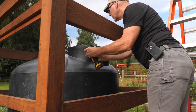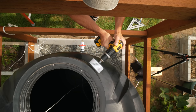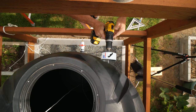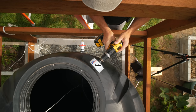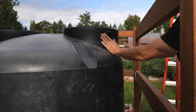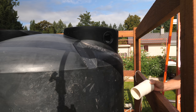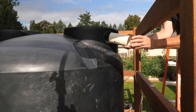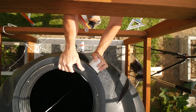I'll use a large hole saw for the inlet and overflow pipes. I drilled until the pilot bit pierced the tank, then clicked the drill in reverse to cut the big hole. This keeps the hole saw from grabbing, and it worked really well. A rubber grommet fits into this hole and the pipe expands the rubber to make the seal against the plastic watertight. Then I push in a short piece of pipe — it's tight and a bit of soapy water helps.